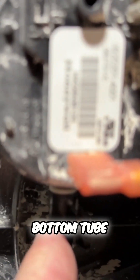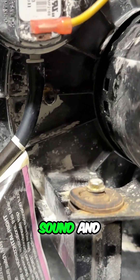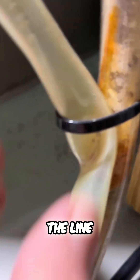I then removed the bottom tube that measures the pressure on the exhaust side and blew on it. When I did this I noticed a gurgling sound and pulsing air flow. This made me think about the condensation that collects from the water in the exhaust. When I checked the outflow drain I found that it was backed up with water and had some material blocking the flow at a kink in the line.